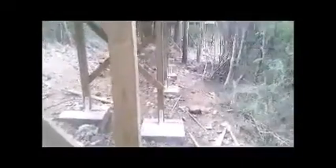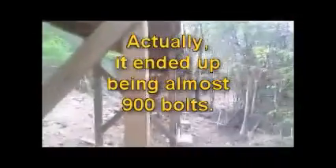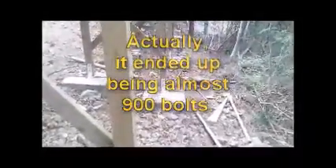I want to let you in on something you don't see from the top side — these bolts right here. As you can see going down there, we have to bolt these 4x4s and the headers with half-inch diameter, somewhere between six and eight inch long bolts. We'll put in probably around 600 of these that we drill and install before we're finished. A lot of hardware goes in underneath. I would say this was probably the most dangerous intersection — nobody got hurt, but being that high up off the ground it's a little squirrely.